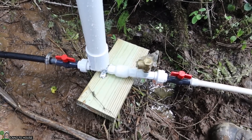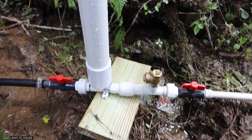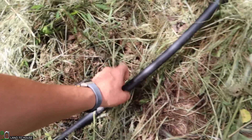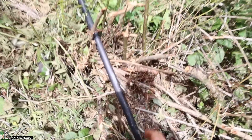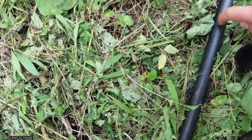The pump is now operating on its own, sending water uphill. Let's go ahead and walk up there and see if we have any water coming out of the top. To determine how far the water has made it up in the delivery pipe — it's full right there. We can move up a little bit and tap again to see how far the water has made it. It seems like it's got water there... it's hollow. If we step down over here, you can hear that it's not hollow.